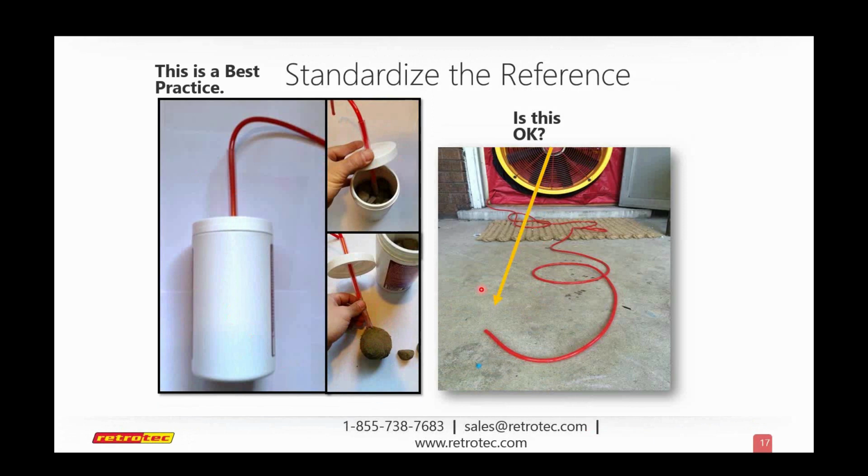And I'll go on to answer another question, where people were asking about, oh, somebody left. I'll answer it anyway. He was asking why his DM32 with the at pressure button doesn't always show 50 pascals. The at pressure button will show the pressure that you're set to. So if you set to 50, it will show you at 50. You can also change the default at 50, and using the set speed button, it will always go to that default.